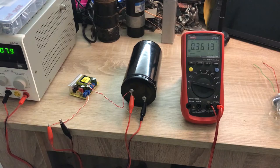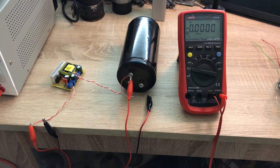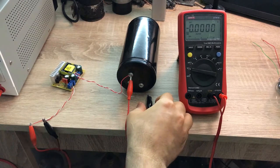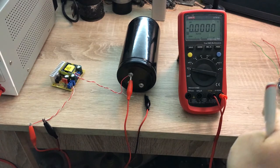It's 10 seconds — I remove the short and we read the voltage. I'm documenting the voltage increase. I've disconnected the voltmeter from the capacitor to avoid discharging through it. Every five minutes I do one measurement. We are close to 20 minutes after removing the short circuit, so I do a measurement now — the voltage has risen to 7.62 volts. From now onward, every 10 minutes I perform one measurement.